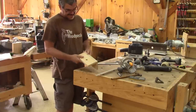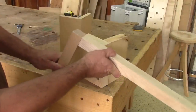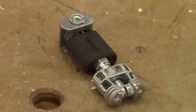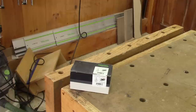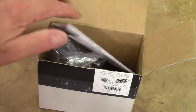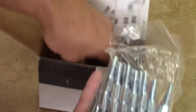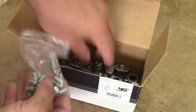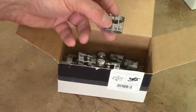But this assembly and the one with the screws are useless if you want to join two pieces like this. So, it's here that I also used the Festool Domino XL knock-down joinery. This comes in three boxes. The first one contains some instructions, the special bolts and some plastic pieces to center this. The second box contains this part, and finally the last one contains the parts that stay inside the mortises.